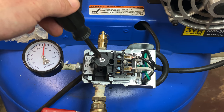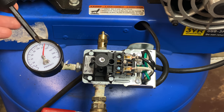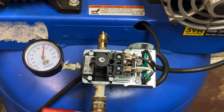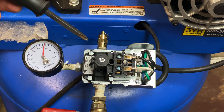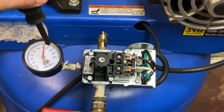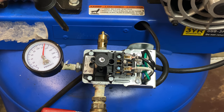With this one, if I've got it set at 125 PSI, when I'm using it, it'll drop to between 95 and 100 PSI before the compressor turns on. That's my main reason for wanting the pressure a little higher — because when it gets down to around 100, sometimes that just isn't enough air pressure for me to do what I need to do.